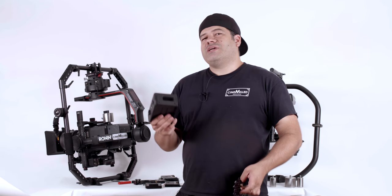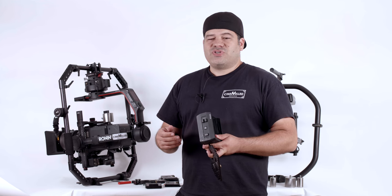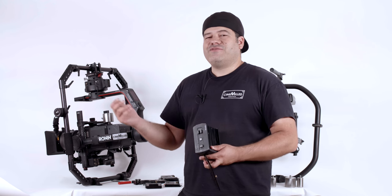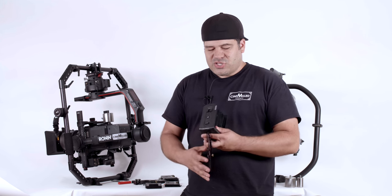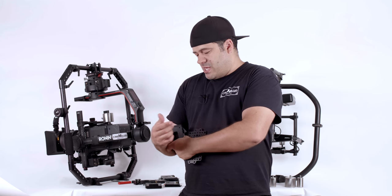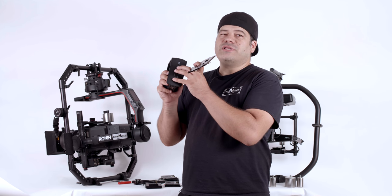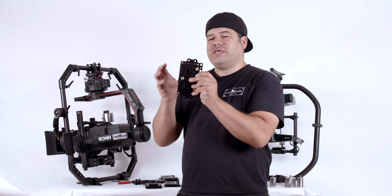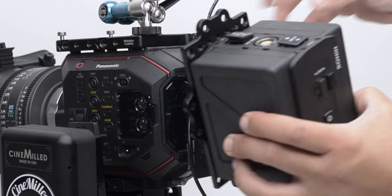The Ronin 2 batteries are really good — they're really inexpensive and they have great performance. I've bought quite a number of them, and I would love to multi-purpose the use of the battery. I'd love to use the Ronin 2 batteries to power my camera and accessories when I'm on a tripod. So what you can do is buy the optional gold mount studs, screw them into the universal battery plate — the Ronin 2 battery power block has two quarter-twenty mounting points on the bottom — and then mount the battery plate to the bottom of the Ronin 2 power block.